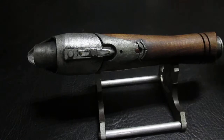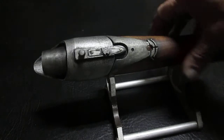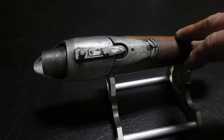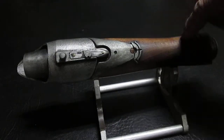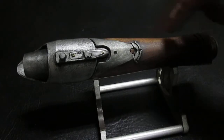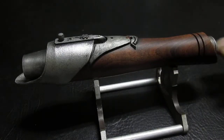I rewired the saber of course, and the main LED is an older Cree red-green-blue with just the blue and green operating on a Spark 2 from Naigon Electronics. There's an 18650 battery from Solo's Hold along with a 28 millimeter heavy bass railmaster speaker, and by shortening the internal dimensions of the whole chassis I've created a lot more area for sound mixing and resonance. So let's hear this thing fire up.